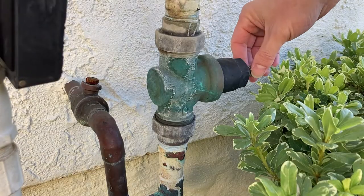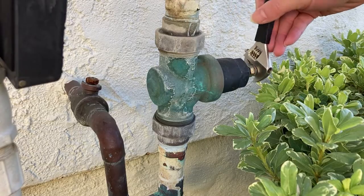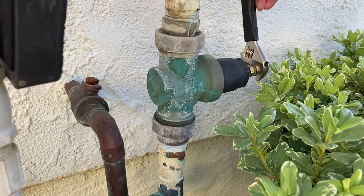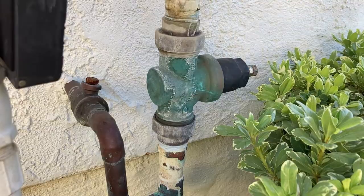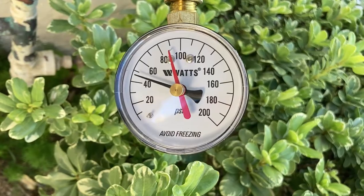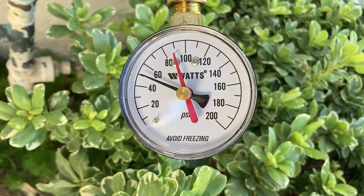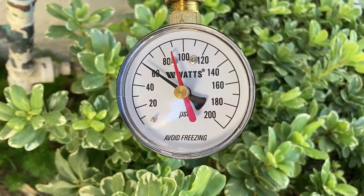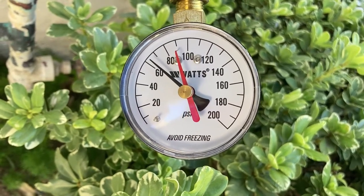Loosen the lock nut on the pressure reducing valve. Rotate the adjustment screw on the pressure reducing valve clockwise by 1 turn. Open the same faucet in the home, the running pressure is now 40 psi. After the faucet in the home is closed, the pressure first increases quickly to 55 psi and then increases slowly up to the static pressure 85 psi in about 50 seconds.